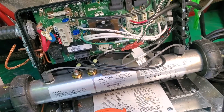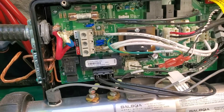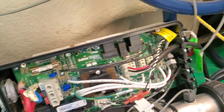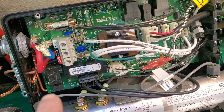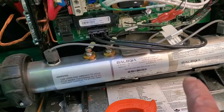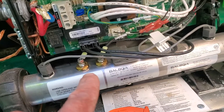We're down here at the control pack. There's some logic on the back of the control panel up there, and some logic down here. The control panel is talking in through here. There is a circuit board transformer in the middle, some relays for the lights up there, some relays for the heater down here. That is a heater tube across the bottom, with two heater terminals getting 120 volts each for 240 volts across the heater.